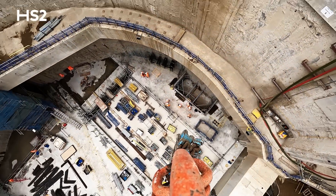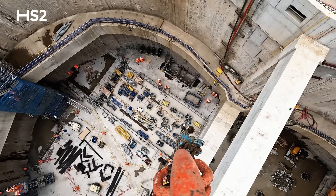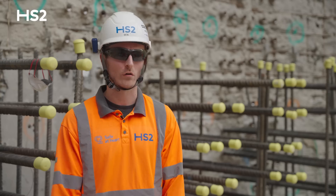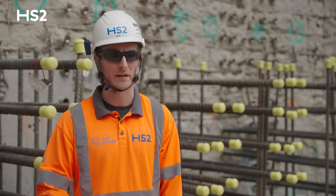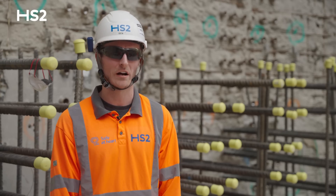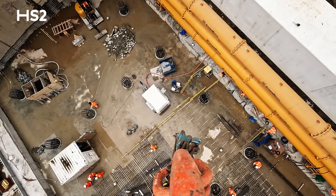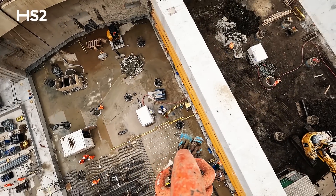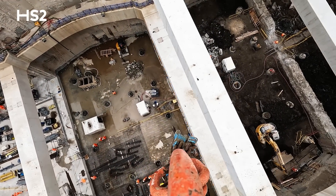The main challenge is trying to pour the headwall in one go. We need to create a 9 metre tall shutter to hold the concrete in, and the green marks you see behind me on the wall indicate where we need to tie the former back into the diaphragm wall to stop it from overturning during the pour. Once the headwalls are complete we need to wait for them to gain strength, which normally takes around a week.